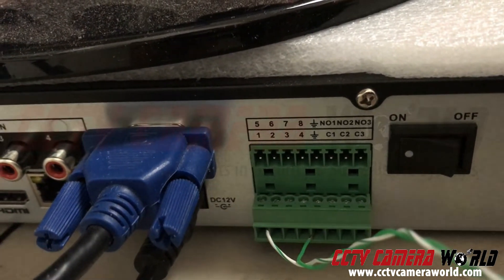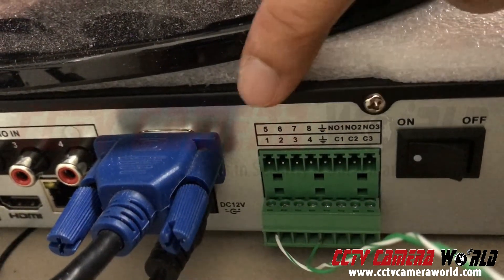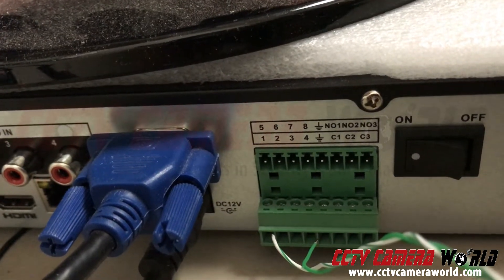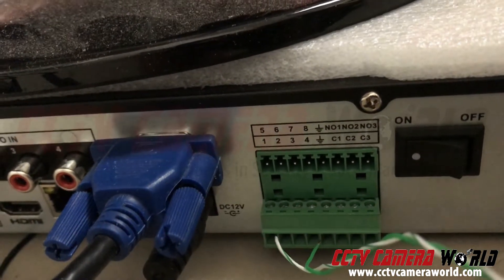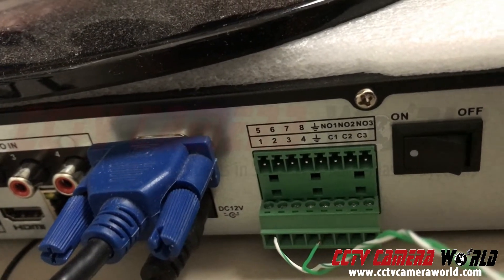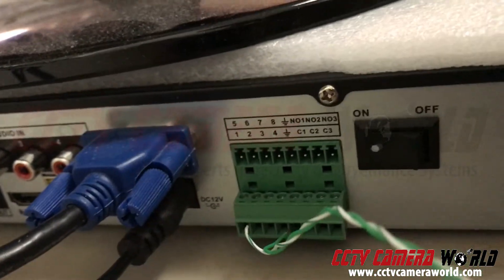I tied them into the first alarm port — the bottom one. If you look at the top here, it tells you what alarm ports are available. On the left-hand side in your video it says on the bottom row 'one' — that's where I plug in the positive cable, and then to the ground on that row I connected the negative cable.